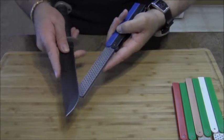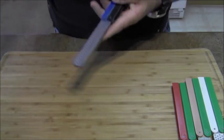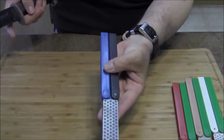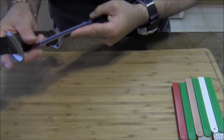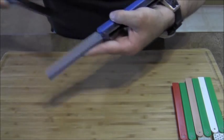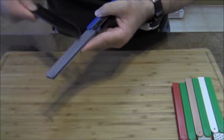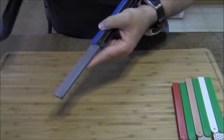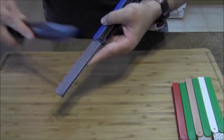I'm still working the K-Bar on the 325 grit stone, but I've decided to go to the hand-lapping style. Two fingers back here, a thumb, and press it into your hand — support the stone in the back. Lay the knife, find your angle when it bites, and follow the stone. Some people are more comfortable with this than doing the file style, so I'm switching to this for the demonstration. 325 grit, five minutes more, then I'm going to move on to 600.